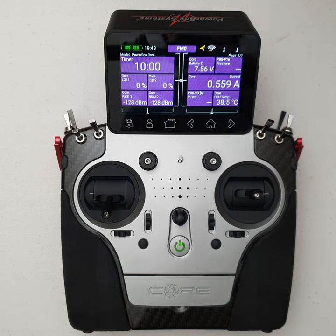I think Spectrum have also introduced this recently, but PowerBox were the first running a text-to-speech converter. Basically, you don't have to copy lots of WAV files or MP3 files into the transmitter. You can just type it out on the screen and it replays that back in numerous voices. You can select from a substantial list of voices in different languages as well.